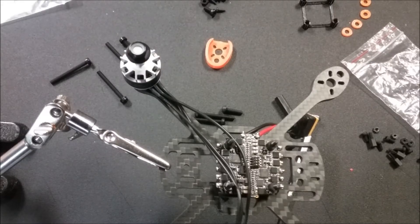The next step is to put your motor on the frame. I'm just going to use one bolt to hold it in place for the sake of measuring the wires to the ESC. Go ahead and do each one going around and connect them to the ESC. I'm going to throw up the ESC diagram for a few seconds - it will also be listed as a link in the description below so you can either pause it or grab a copy yourself.